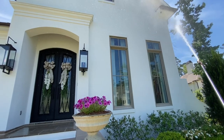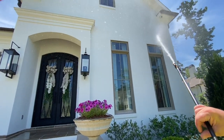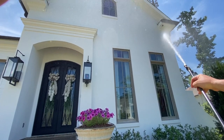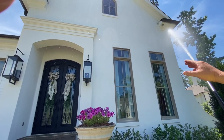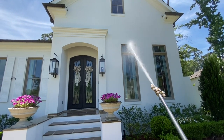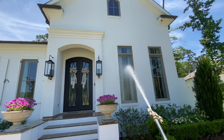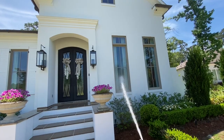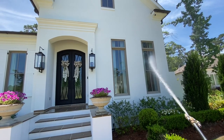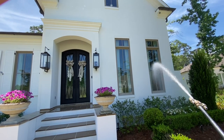Right here we want to start looking at the corners of these windows to see if any nests are forming. The soap nozzle gives a little too much pressure to put directly in that corner near the glass, so I have a couple of options: lower my RPMs on the machine, or back up. I'm at least 10 feet away from these corners. Using a circular motion is really important — not pushing water at a 90-degree angle to the window, but with a slight deflection. That lets the impact spread across the glass, seams, and frames for a really thorough rinse. The glass is usually the last thing I rinse when doing the wall, so I don't have any debris flowing back onto the glass after.